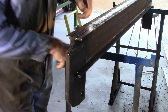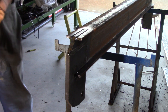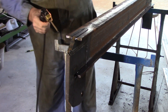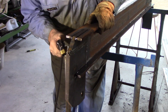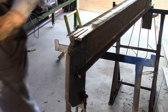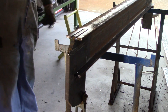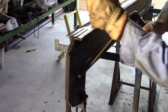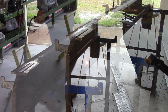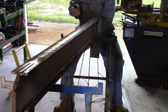The next job on this wood splitter — I've tipped it upside down. I've got to weld along here on both sides and up along the bottom. This has got to be flush because it's getting the reinforcing SHS put along there. I'll start off on the bottom ones with the 7024 I've been using. I might switch to some thinner 7018 for the top ones so I don't build up too much weld. I need to turn the welder on. I'm running these at about 180 amps — the manufacturer's recommended maximum for these rods is 190, and they're working really well at 180.